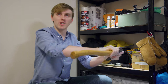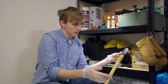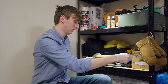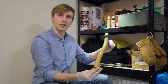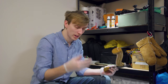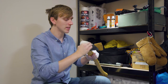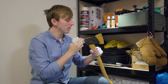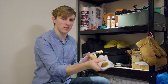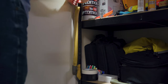Day two! There we go — one shiny axe. It's coating it quite nicely. Now I'm going to take off the excess. I love the wood effect it brings out, it really brings out the wood. The main thing about excess is it creates too much of a hardened coating on the outside of the handle, and when you're working with it that will give you blisters because it goes quite tacky. Then I'm going to hang this back up and let it dry.